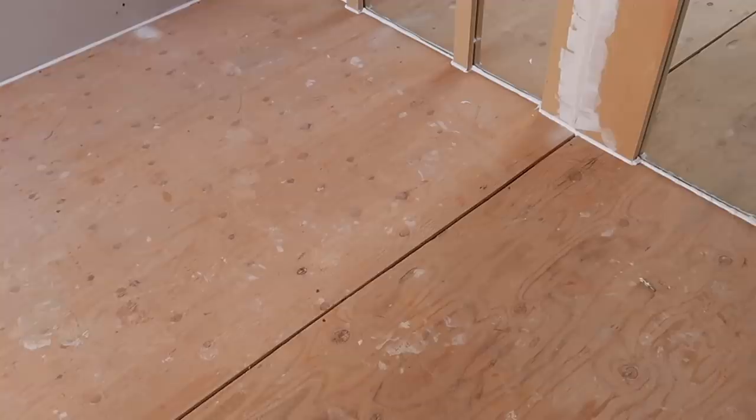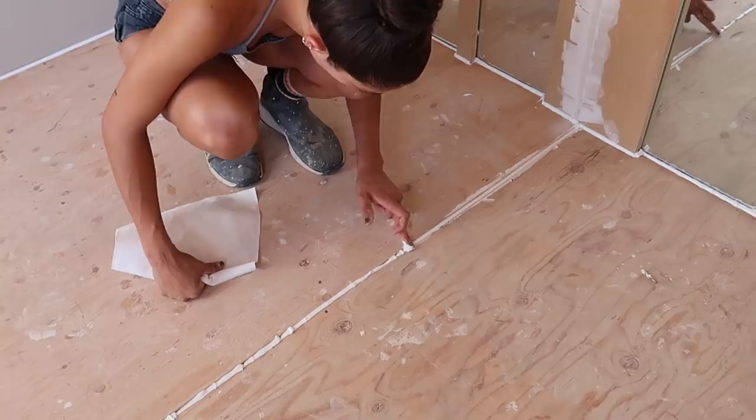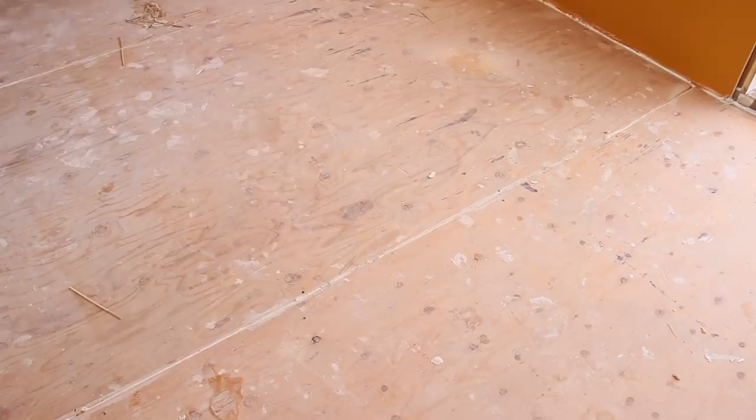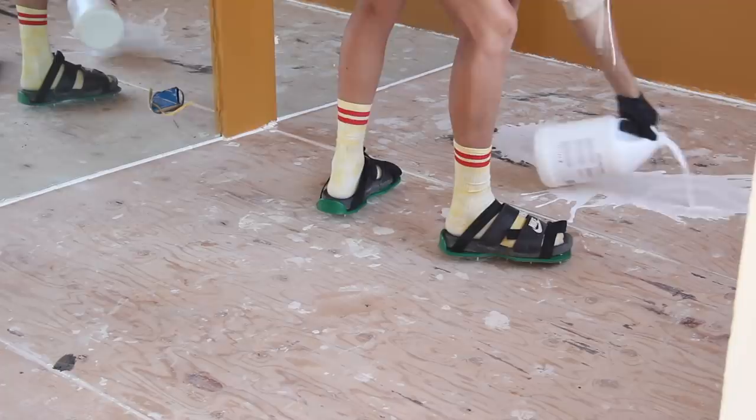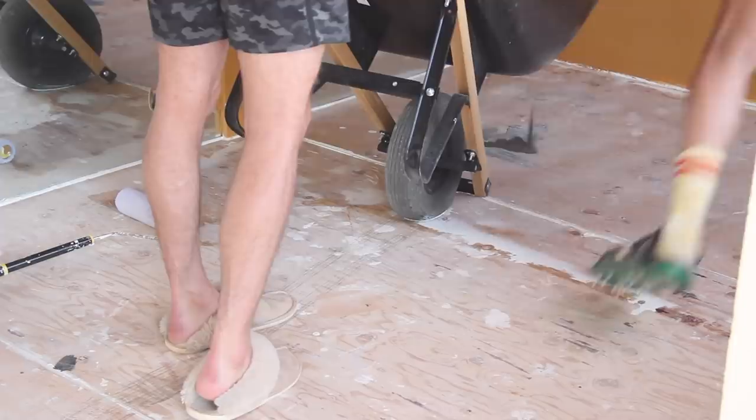This is single-handedly why this video took a month and why I have been dark for so long, and that is because it took me 3 weeks in total to pour the floor successfully. I started by prepping the subfloors by sealing it with some caulk all around where I saw gaps, prior to sweeping up the debris and removing any uneven spots before I added an adhesive to the subfloor to then pour a self-leveling, basically concrete on top of it that you typically use for under laminate to be a DIY cement floor.